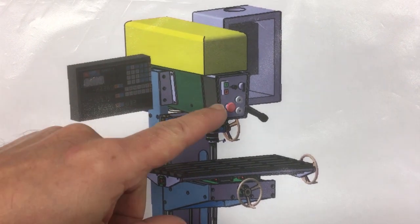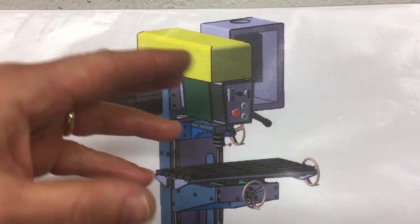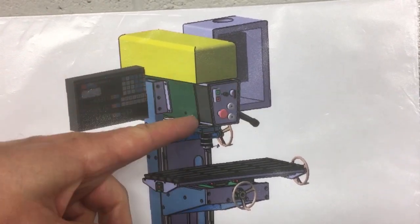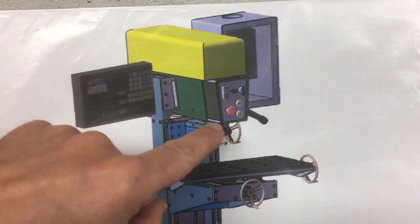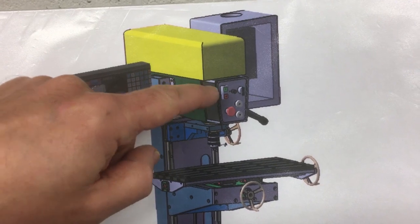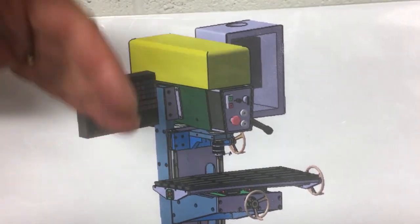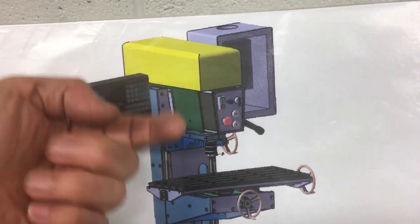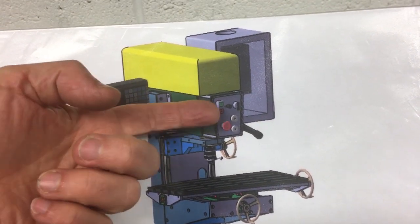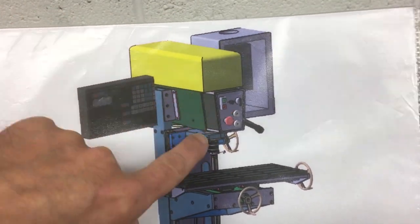Right, so now we're going to make the control box here. So we'll make this up in individual pieces, fabricate it, and then assemble it. So the back panel will have slots machined in it to take these side pieces, and then you've got these bars at the side that will also have slots machined in them, also to take those side pieces to kind of slot in. And then on the reverse of this front panel, there'll also be slots machined in that to take those panels. So it will kind of interlock together, and then we'll just screw it together.